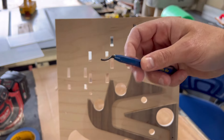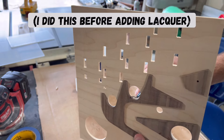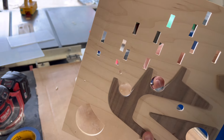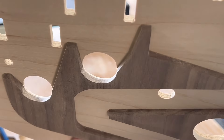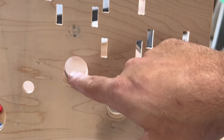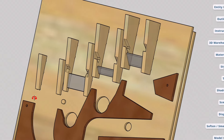Once dry, I'll insert the acrylic into its place and then glue that piece onto its designated location on the front panel. Next, I need to glue a tiny piece of quarter-inch dowel into a hole on the front panel, making sure that only an eighth of an inch is protruding from the top. This will act as a little bumper for the pennies to make sure they stay on the right track, but it won't be visible once everything is assembled. After that's done, we need to use a deburring tool to shave away material behind the two holes that will corral the pennies and nickels, making sure that the pennies are guided to the back of the panel. Make as steep of an angle as possible here.